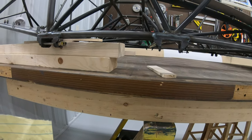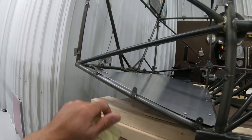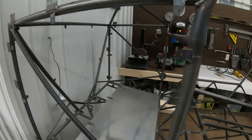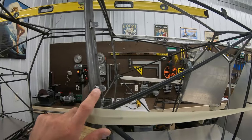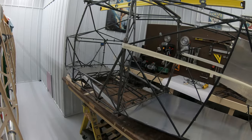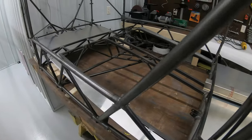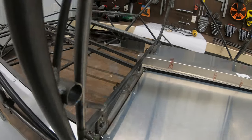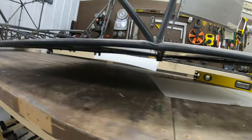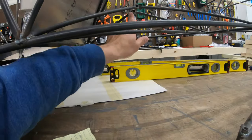I did get the front tabs welded to the front — there'll be a window that I put in. I got the rear tabs as well. He recommended both of these, and this is what he's got on his plane, Yeehaw 6. I also got the elevator push-pull tube guides welded below the fuselage, so they run below the baggage floor pan and come up at the bell crank assembly.